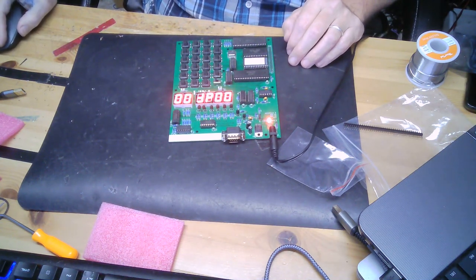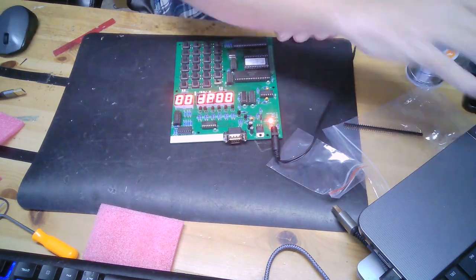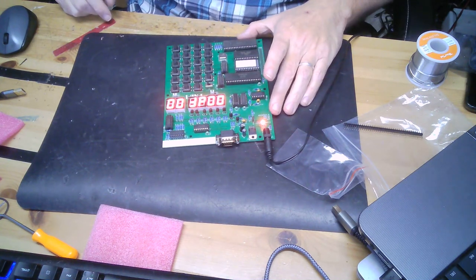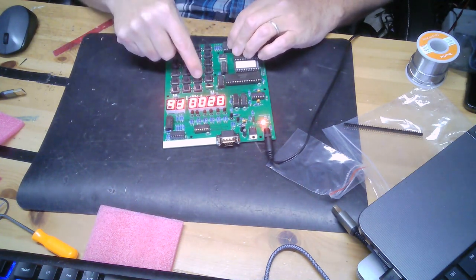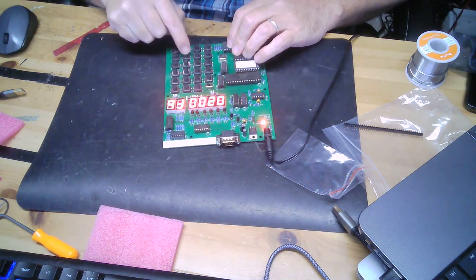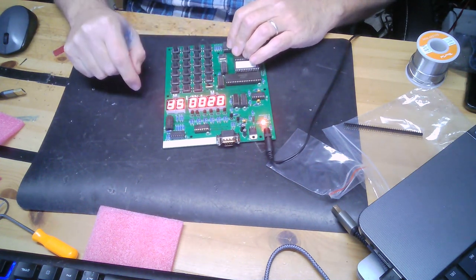Okay, I'm going to enter by hand all the hex code for WAVE, which is, I don't know, hold on a second. Maybe I'll find something shorter. Yeah, this one's going to be a lot shorter. I don't feel like putting in all that, so watch me. So 0200 and DA, because we're going to do direct access of the memory. A9, let's see, A9, where's the plus? Here we go. 7F 8D 41.